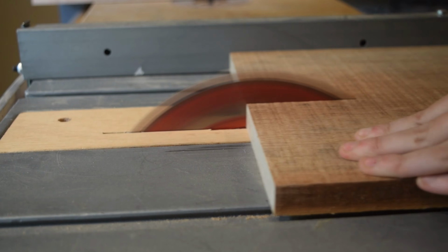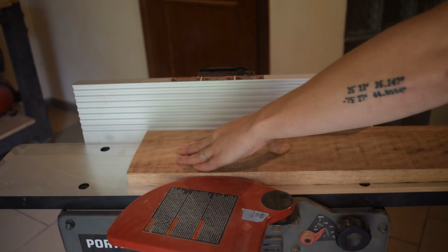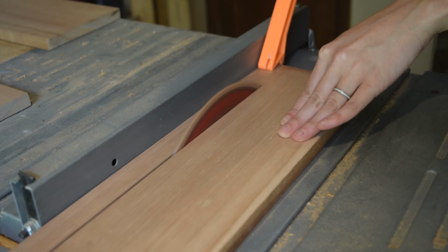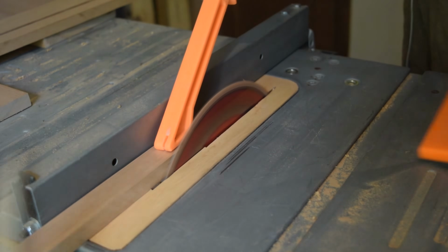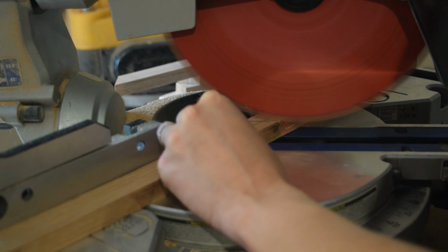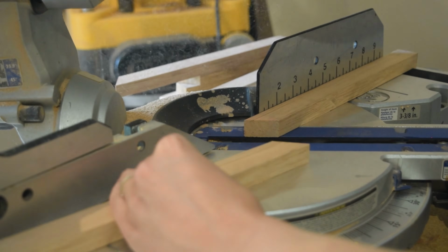First, I had to prep the raw cut lumber. Cue planing and jointing. Then I cut a few planks down to 1-inch strips for what would become the display's legs. To achieve the legs' frame shape, I cut the strips down to size with angled miter cuts. To the rear of both frames, I achieved a 90-degree angle by cutting the adjoining pieces at 45 degrees.